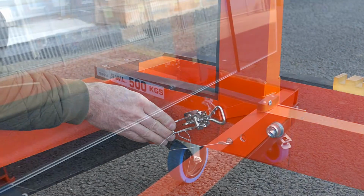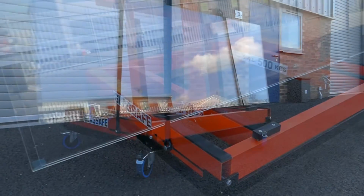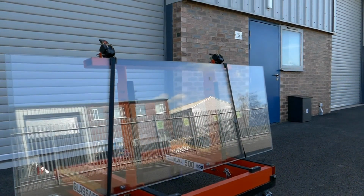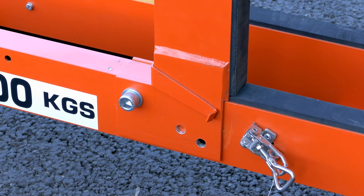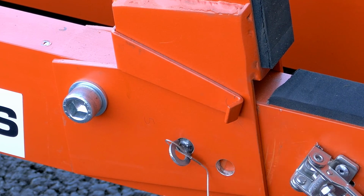The stillage can be used to carry uneven widths of glass and uneven thicknesses in the same batch load. The vertical frame section needs to be put into the forwards pitch. This is achieved by firstly removing the turn screw mechanism from the top frame. Remove the holding pins adjacent to the bottom pivot points. Tip the top frame forwards towards the castellated base rails.